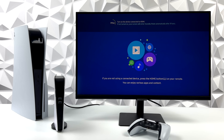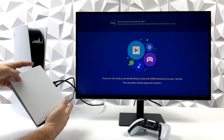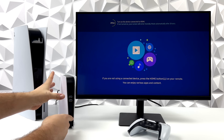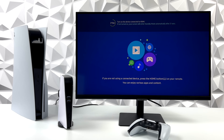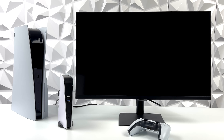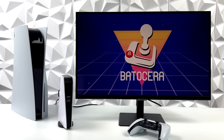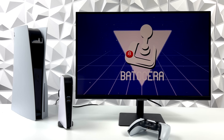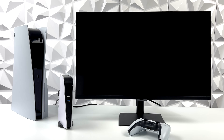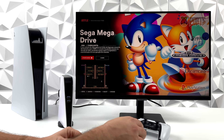I've installed Batocera to a micro SD card and threw a few games on it. We've got HDMI and USB Type-C power in. I've set the script up for the button — it's a simple on and off script. It'll shut down safely and start back up once it's shut down. The first time you plug it in it's automatically going to power on; that's just how the script works. A lot of images already have that script built in — you just need to enable it from settings. I'm running the latest version of Batocera 33 as of making this video. I've done a bit of testing and haven't had any overheating problems. I'm not overclocked given I don't have a huge heat sink, but the Pi Shim works well with stock clocks and it's not thermal throttling at all.